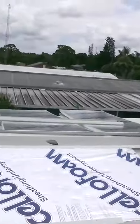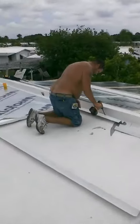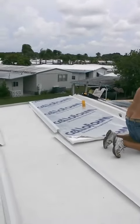What we've got here is an aluminum, insulated roof going on this mobile home. It's got the old skin on it now. Dan's just running the z-bar and perimeter angle, and then we'll be putting the foam in.